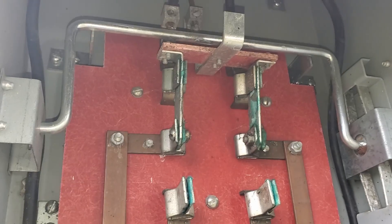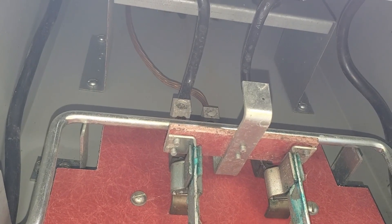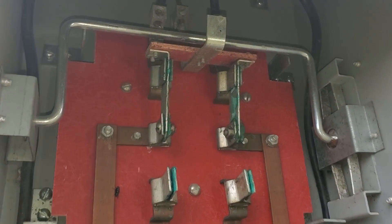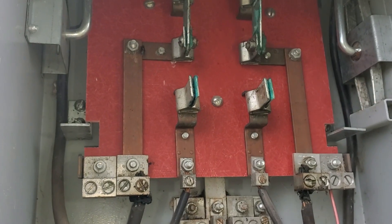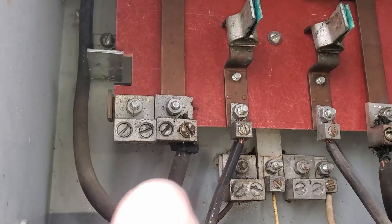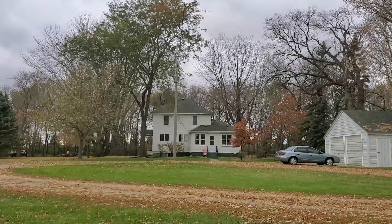When it's in the up position, those two blades right there are connected to our grid power coming in from the top. So you can see how if we were to flip that lever to the middle, it would then disconnect from the grid. You can see those copper bars right there, and those ultimately connect down — we have one leg of power right there and the other leg of power right there, and those wires ultimately feed the main panel inside of the house.